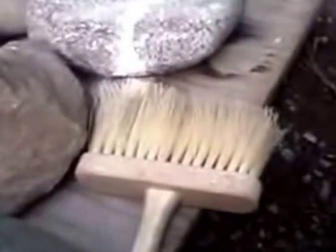And then the mason's brush. This is extremely useful for many things. You can dip it in a bunch of water and sprinkle your joints like that, and you want to do that to help slow down the curing process. Then also you can brush them down and just get your tooling marks out. So these are very important. With that being said, we have our tools. Let's go ahead and get these dry mixed and let's start laying some stone.